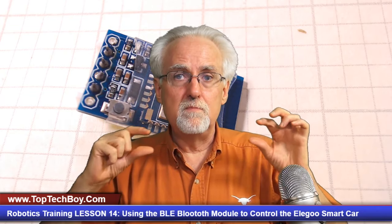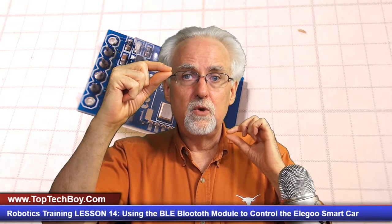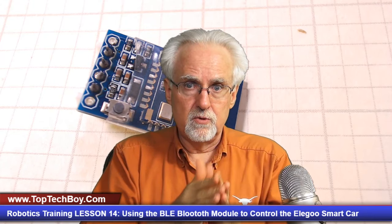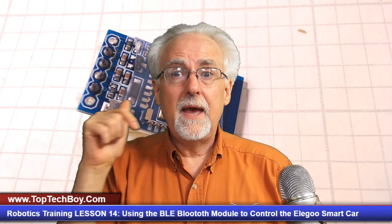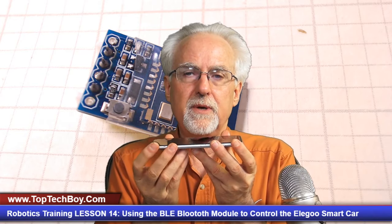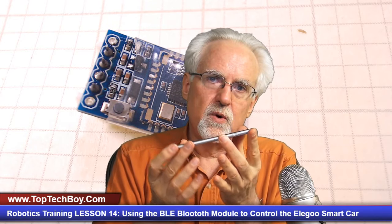In effect, you have a target, you have an actual, the difference between the target and the actual is the error, and then you use the control system to drive the error to zero. Now, we haven't done this in this series of lessons, but on my channel, there are two places that we've used closed loop control. One is on that self-leveling platform where we have an inertial measurement unit, and as you tilt something, it corrects itself to keep it flat. We used a PID controller on that.